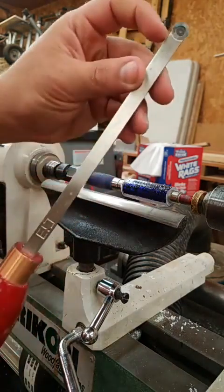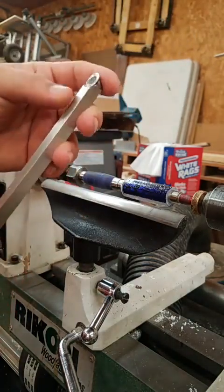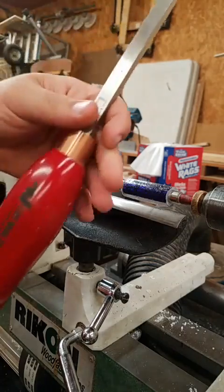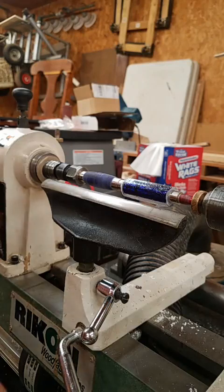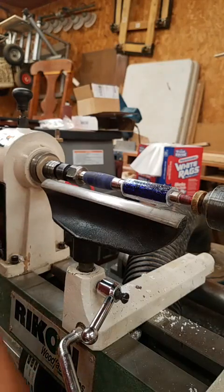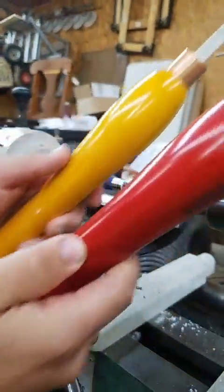All you got to do is cut your groove in here. You can do that with a file. Drill and tap one hole, and then put it on something you can turn yourself. And you can have your whole carbide tool for 20 or 30 bucks. My father-in-law got me the 2 of these for Christmas 2 years ago.